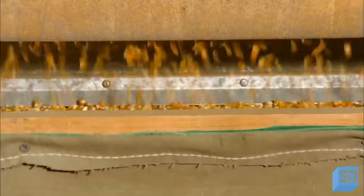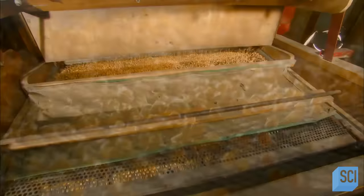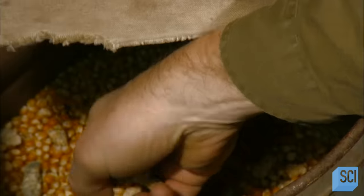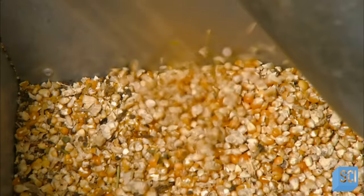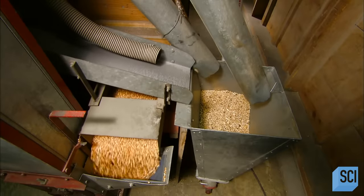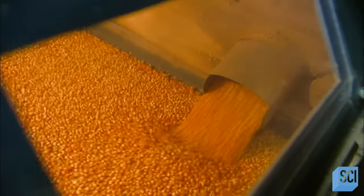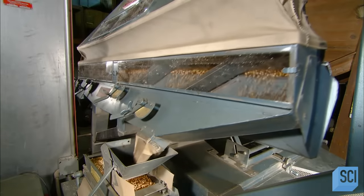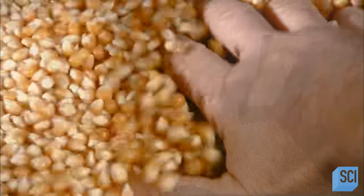In the factory, a series of oscillating screens sift chunks of cob and broken kernels out of the popcorn. Vacuum pipes pull the finer impurities to a dust collector and suck the larger impurities into a chute, ending up in a waste bin for animal feed. The purification process continues at the gravity table — its vibrating action, along with powerful fans, causes the popcorn to rise and float on air. Kernels that are too heavy or too light gravitate away from the center and are shunted aside, leaving optimal-size grains in the middle.